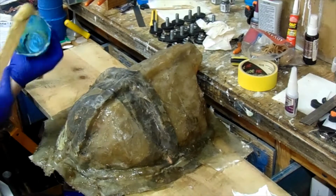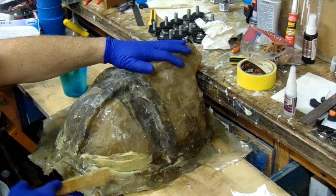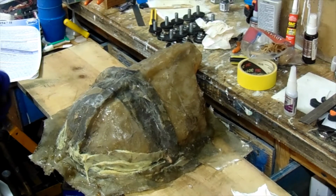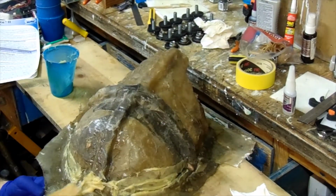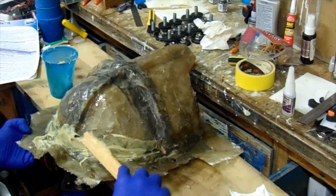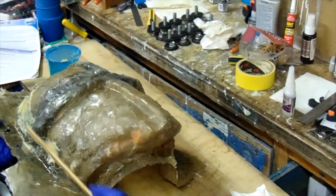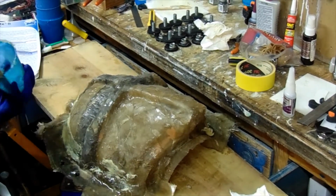This half here, the face of the mother shell, didn't sustain as much damage to the inside. It was generally all outside. As you see around the flange edge, there's some extra fiberglass sheets right there. What I'm doing is I'm just creating a seam between the original fiberglass and the new fiberglass flange pieces, just for stability.